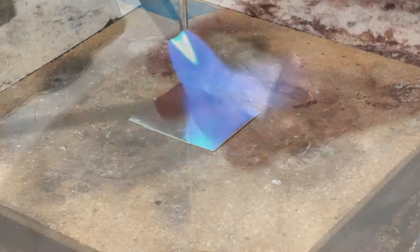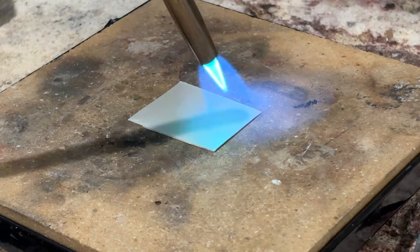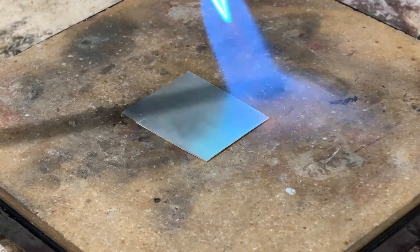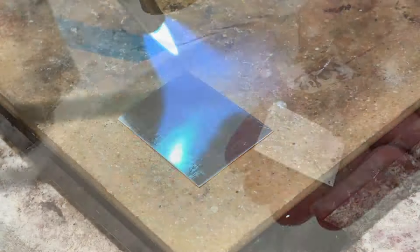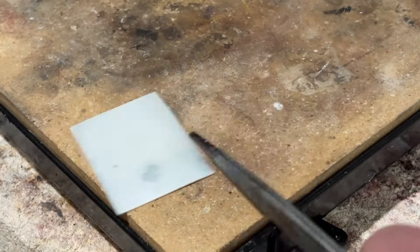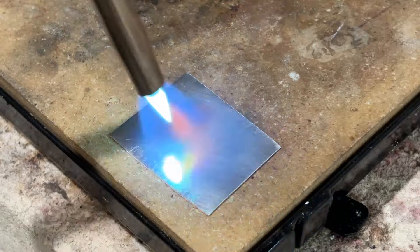I've now sped up the process to about eight times actual speed, just to give you a sense of the full cycle. I went through the complete cycle of heating it, pickling it, cleaning it, and scrubbing it with the brass brush — a total of eight cycles. At the end of this, there will be an image of the completed piece with the depletion gilded surface. You can see some dark spots where either flux or the copper is oxidizing on the surface and is subsequently being removed by the pickle.